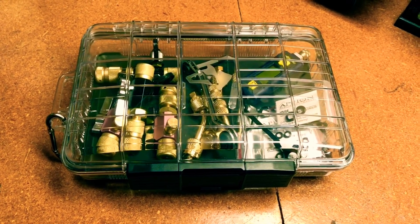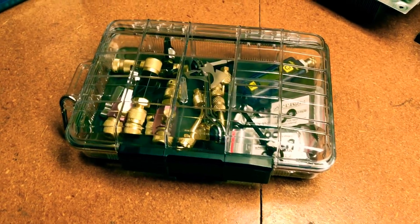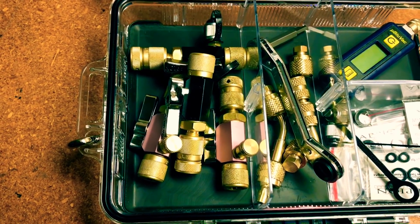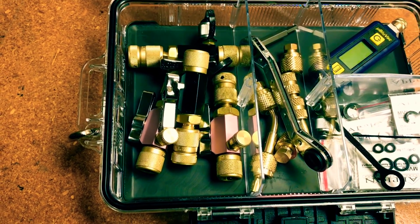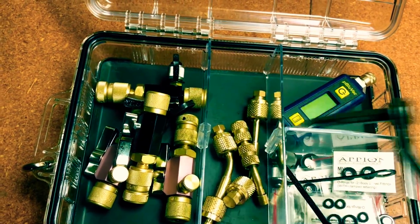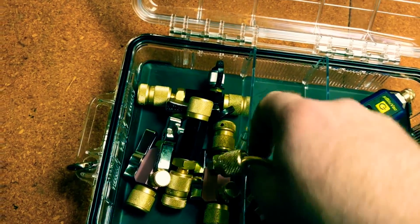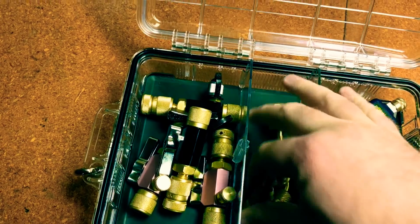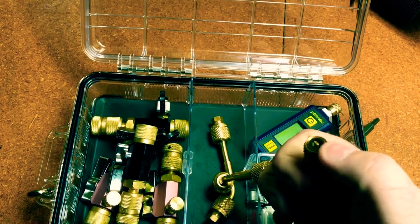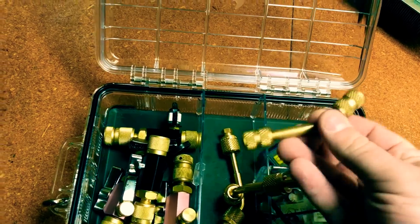I can see everything from the outside, and if it's raining or more humid than I want, I don't have to worry about these things getting contaminated. Inside I've got a set of Appion core removal tools — five-sixteenths for mini splits and VRF, and quarter inch for everything else. I keep a service wrench with an adapter for opening up new valve stems and releasing refrigerant into a new system. I've also got my micron gauge coupling — the brass fitting that actually came with my micron gauge. Great concept, but I'm not crazy about the gasket and depressor situation — they're not easy to change out and I've had it leak on me.